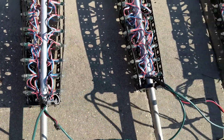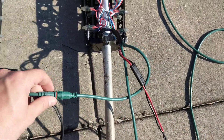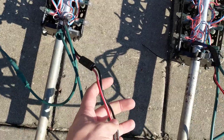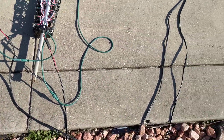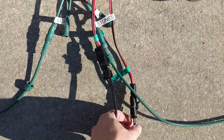So again, three poles: the one pixel in off the port off the F4, pixel out from the first pole goes into the second, and pixel out of the second goes into the third. Each pole has a single power connector. In this case, I ran the power connectors as 14 gauge landscape cable, and that 14 gauge landscape cable comes to my power connectors off my box.